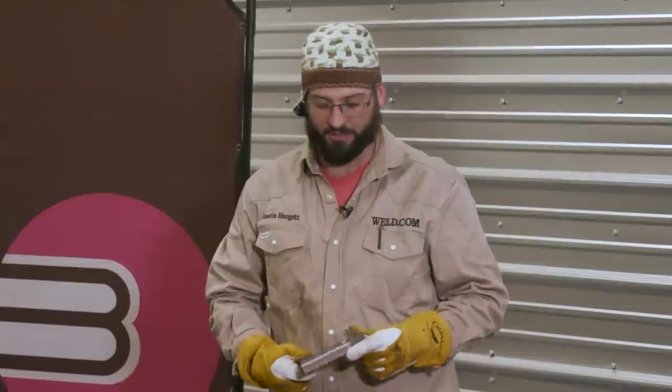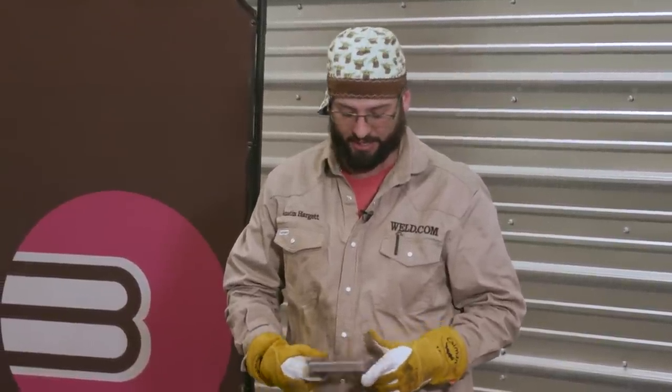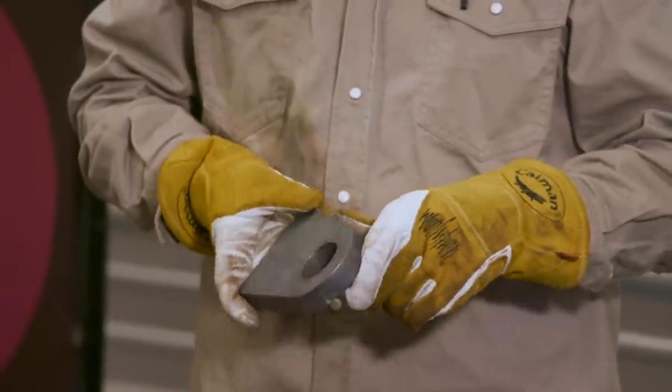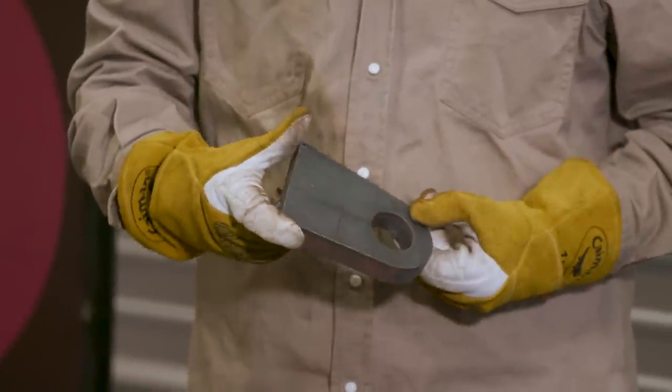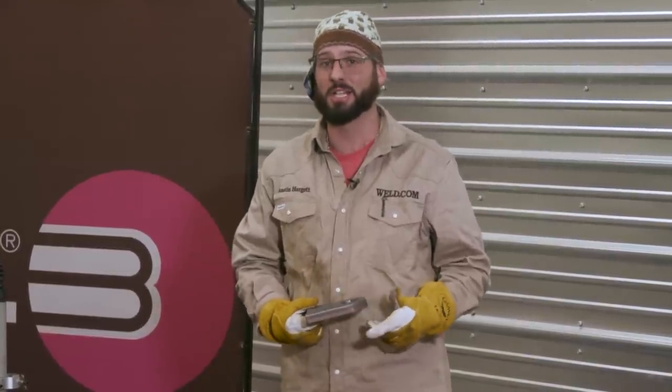You can clearly tell that the Extra Fire and X-Track combo is pretty awesome. We got a nice smooth plasma cut, a nice good pierce, and a nice good hole. Looking at it dead-on, I can see there is a little bit of a chamfer — some angle — so we might need to adjust some of our travel speed settings. But overall this thing is cutting really slick on the plasma table.